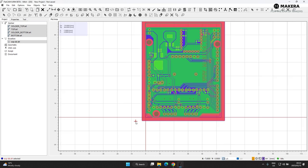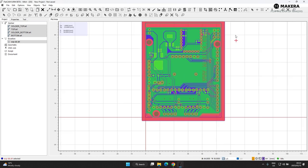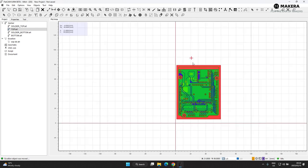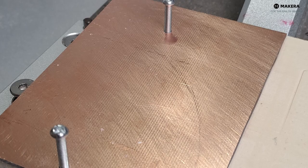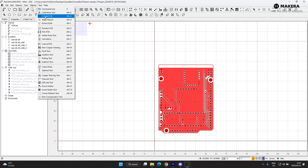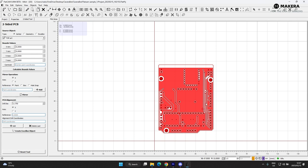Exit the editor, save the changes, and you can see both layers are now the same color. Set one color to brown for the corrected drill layer and delete the incorrectly scaled one. Now everything is lined up. I usually think of this corner as anchor point one — you can also use anchor point two or do a manual location. Select all files, hit M on the keyboard, and move the whole thing, leaving a little space at the bottom because we want to create mirroring flip holes at the top and bottom. To set up alignment holes go to Tool Options > Two-Sided PCB.